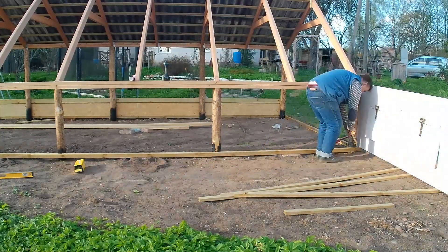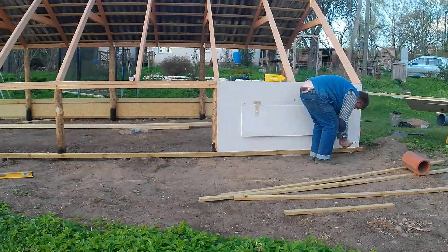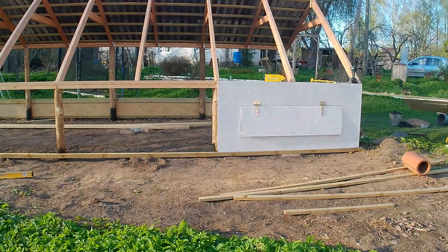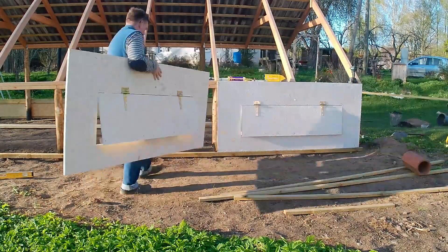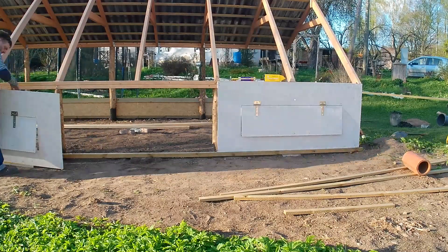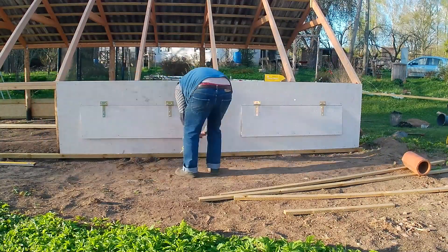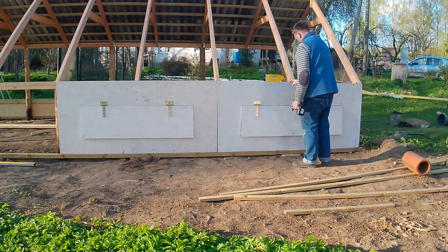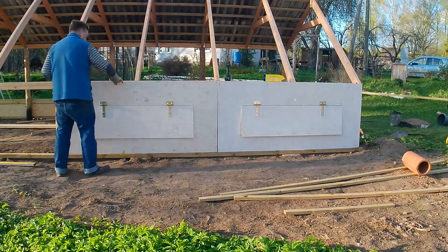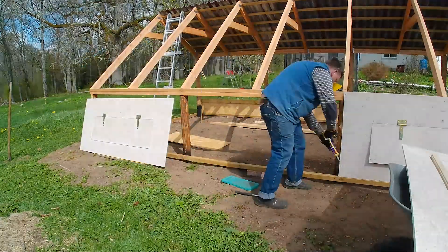I've made up the panels now. I didn't video all of it because it's just a replication of what you've already seen. The only real difference is the new hinges — a lot more robust and heavy duty, so they'll be great. As I fit each panel I'm sealing them in using some all-weather sealant on the joints. I put the panel up, pencil along where it's going to sit, then put the sealant along that pencil line so I know it's exactly right. For now just two or three screws — I'll go back later, fill it permanently, and seal it with a finger line, just to eliminate any potential weak spots even though they're all done with waterproof paint. Better to be safe than sorry.